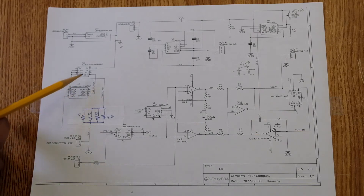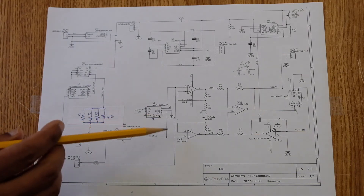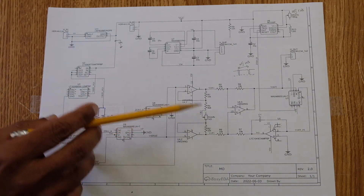This is a more complicated approach, but the reason for doing it this way is to be insensitive to gain errors. The goal is to have a fixed gain while having offsets cancelled by the offset cancellation circuit, rather than worrying about accurate gain — since gain can be adjusted using the R_gain resistor in the instrumentation amplifier.